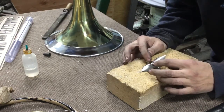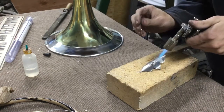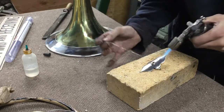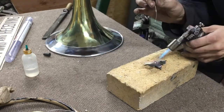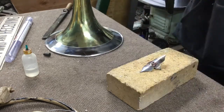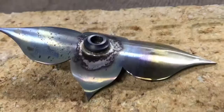Centered up — doesn't even have to be really centered, no one will ever notice. I heat it up with a butane torch, put all my heat on the thing. Sometimes it slides when the flux heats up. I just put the solder down the center of the hole so I don't have any entry points showing around the outside — just a nice ring of silver solder. Boom, that's it. That's all she wrote.